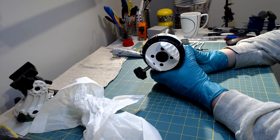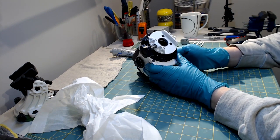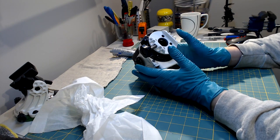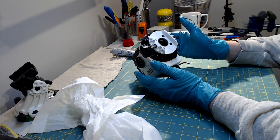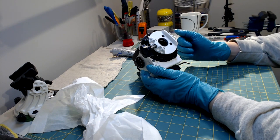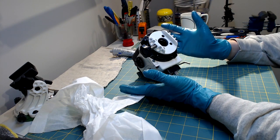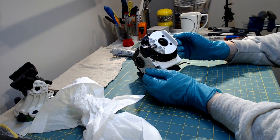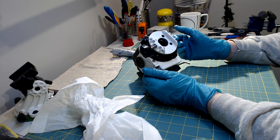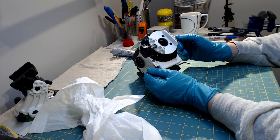That was very warped. So if you're not a handy person, and if you don't have patience like that, and yet you still have the ability to take your mount apart, you can take that clutch plate into a machine shop. And yes, I said they could probably make you one. It would cost you quite a bit. But you could also get them to put it on a lathe and they can clean up that high spot off of there for you, and so basically straighten out your clutch plate. Probably wouldn't cost you too much. You can even get those hobby lathes. I kind of wish I had one for this situation. It would be perfect. But other than taking a lathe, cleaning it up, or doing it the way I did, the only other option is to say, hey, Skywatcher, my clutch plate is warped. Send me a new one that's not warped.